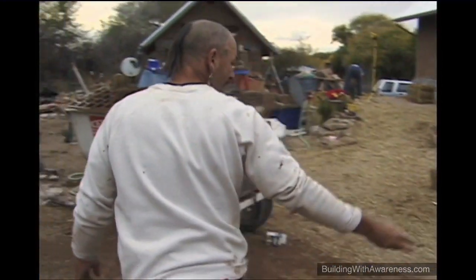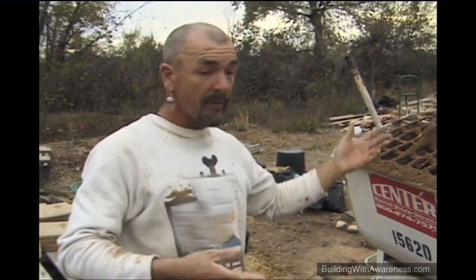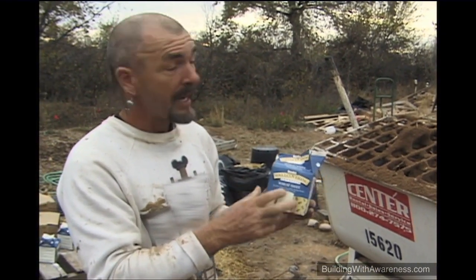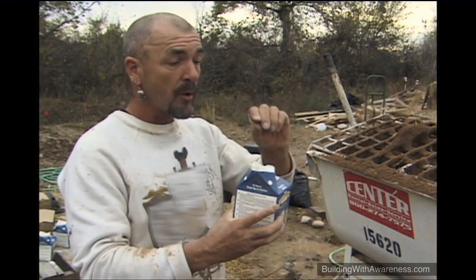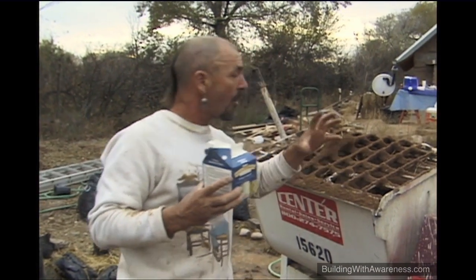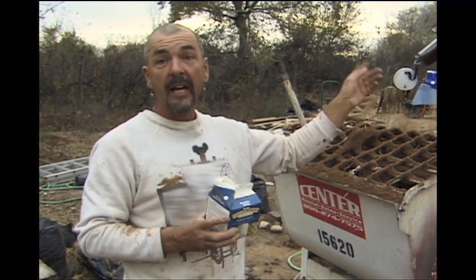After screening, we take that clean mix, throw it into the cement mixer, and do basically 12 shovels of it. Then we add four large hands of chopped straw and put in half a pound minimum to three-quarter pound of wallpaper wheat paste as a binder. Mix it dry first so each molecule mixes around — it has to be dry and mixed. If it's wet mixed, you normally get little balls forming and they end up being pockets on the wall. Then we add the water and mix it to the consistency of a mousse — just moist enough so it spreads real easy on the wall. That ends up being the mud plaster mix used on both outside and inside walls.